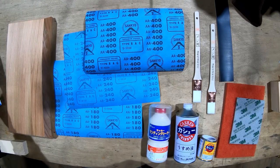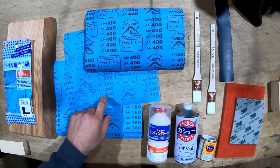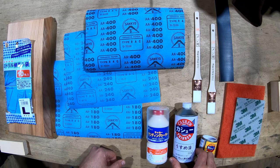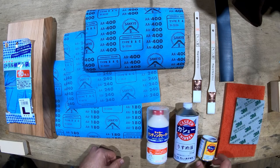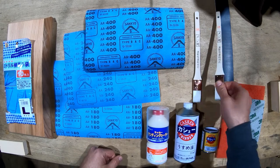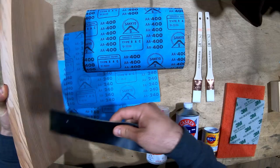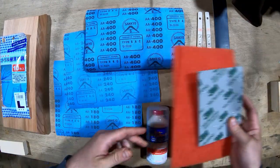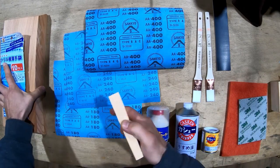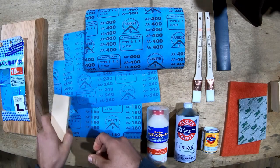You'll also need some gloves because all lacquers can irritate your skin — it's basically poison ivy oil. You'll need 180, 240, and 400 grit sandpaper, some sort of sanding sealer, a thinner for your lacquer, and of course the urushi or lacquer. Here I'm using a cashew lacquer which dries faster and causes less irritation. You'll need some quality bristle brushes, two strips of stick-on rubber for the bottom, high grit sanding pads or scotch bright for a final polish, and a few blocks of wood or a sanding block so that you can sand a flat surface.